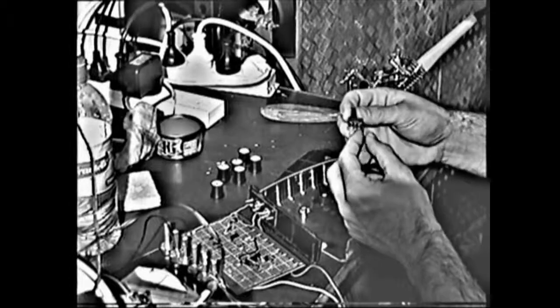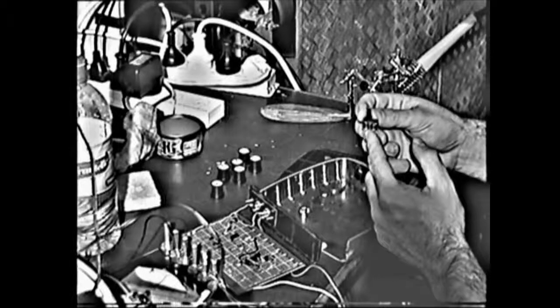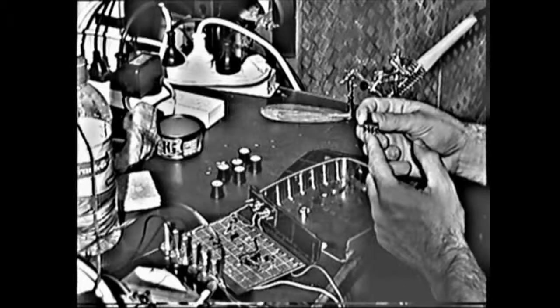So basically when the switch is in off position for the power, I want the two video leads to be connected from input to output. But when the power is on, the short between the video input and the video output is open circuit. That's the whole idea, because that way it switches the effects unit off and it just sends the video straight through.